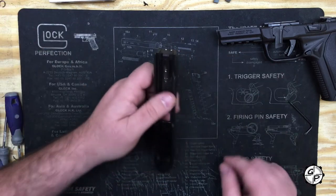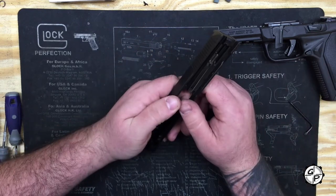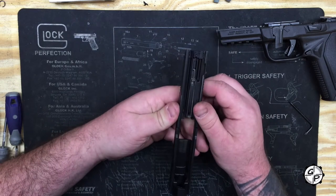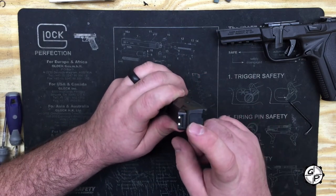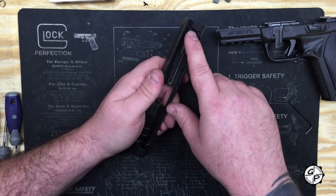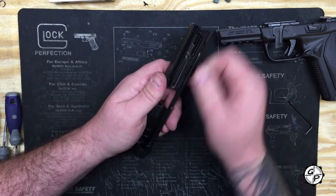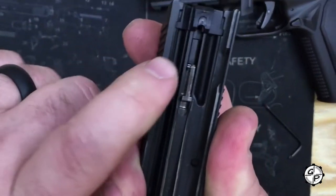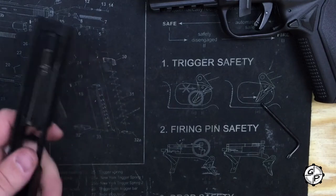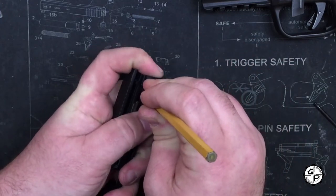We'll set the barrel off to the side. Now, the one thing that's a little bit different with the Ruger American as opposed to the SR series is when you go to take apart the slide and take the striker out of the slide. There's no pin like the old series had. On the new SR series they didn't have an actual hole so you could get a punch in there — you just had to take a pick and pry it. The Ruger American now has a nice little hole right there where a 1/16th punch is going to fit in perfectly. Slide it down in, push the striker forward, and the back plate comes right off.